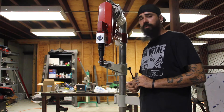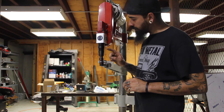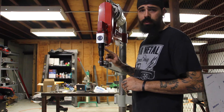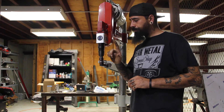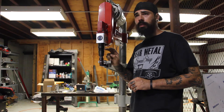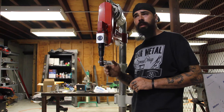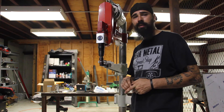There's also more versatility in the fact that inside of the head, there is a piston and a weight. There are three different weights available: a lightweight, a featherweight, and a heavyweight. Your heavyweight is for thicker gauge material. Your lightweight is for sheet metal, 18 to 20 gauge, anything in that range. And your featherweight is for something more malleable — aluminum or copper, anything in that range.